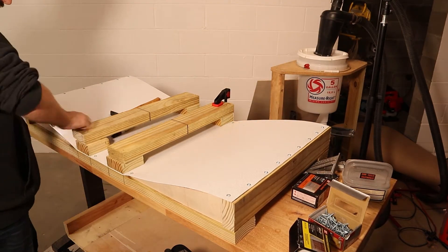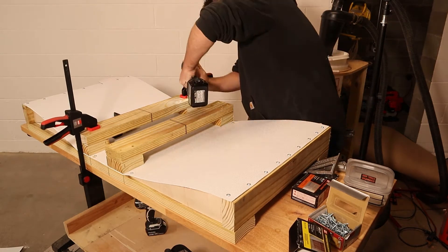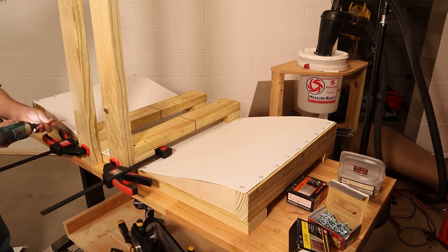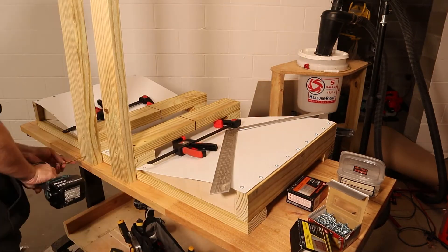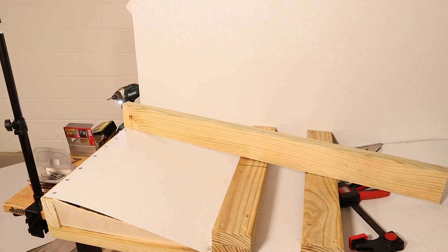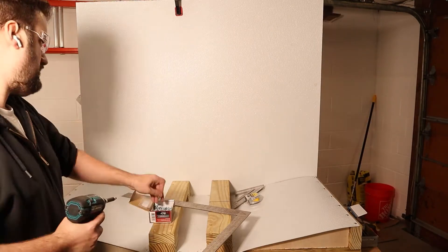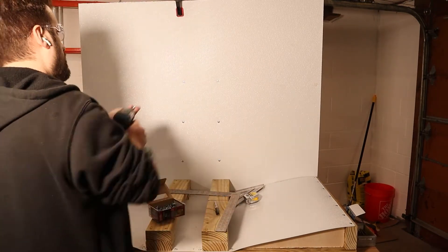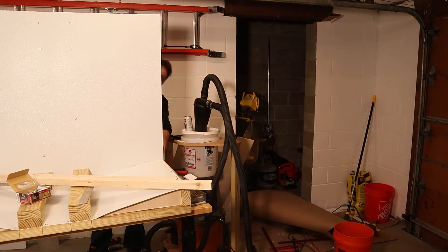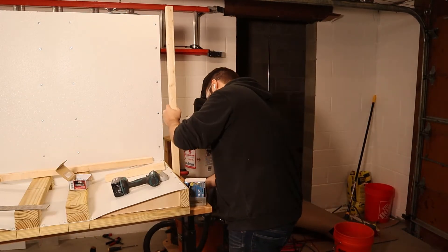A few more screws — I used 3-inch screws for this, screwed them as squarely as I could, and used clamps to keep things in place during assembly. You don't need to get these perfect just yet because you'll need to take them off one last time to seal around the entire enclosure. Now I'm building the back. It was important to me to have a strong back on this enclosure because I'm pretty much going to hang most things off of it. I put two 2x4s there, 3 feet high, using a square to keep it accurate. From those 2x4s I'm hanging a 3-foot high by 4-foot wide piece of that same white plastic sheet to form the back. I'm also taking some 2x2s and shoring up the frame along the edges to cheaply define the rest of the shape of the enclosure.